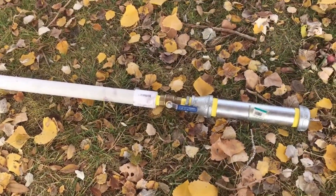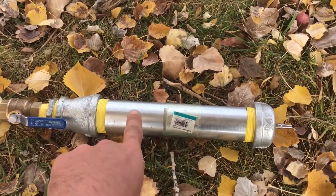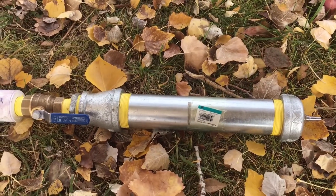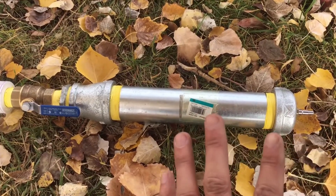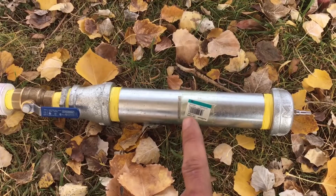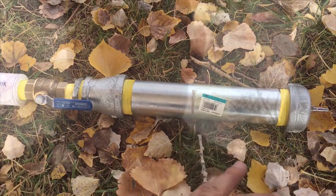Mine was around $90 to make, but you can make them cheaper. If you want to use all PVC — the reason I chose galvanized steel for the air chamber end, which made it more expensive, is that the chamber is the part that builds the pressure. We've already put around 150 PSI in it and it held fine. With PVC, I was afraid that if I dropped it while it was charged, it would explode and become shrapnel everywhere. I chose galvanized even though it was around $40 more, just for the added safety.